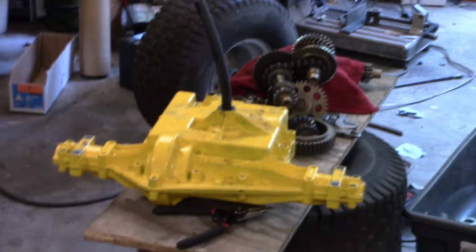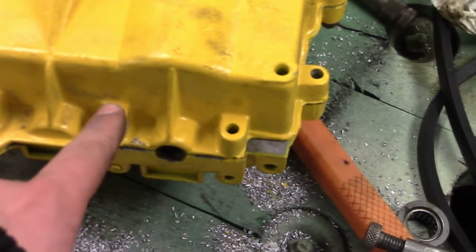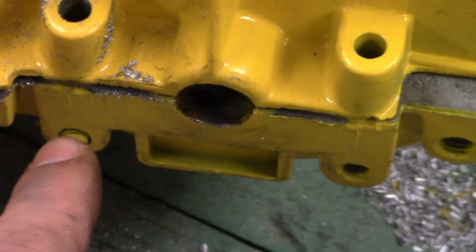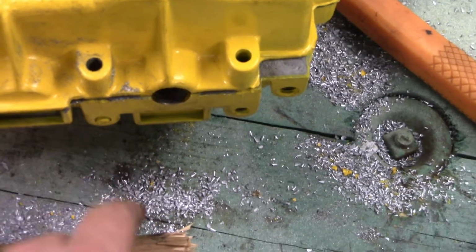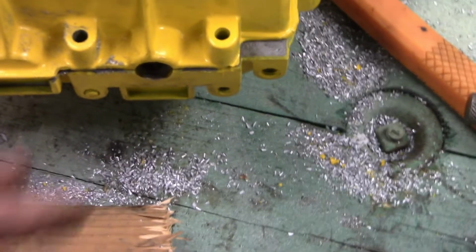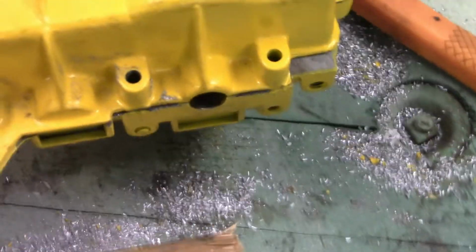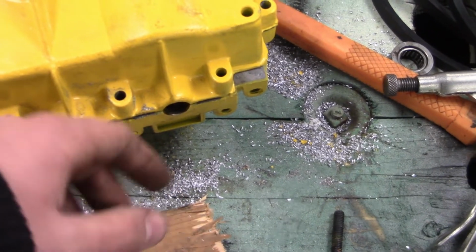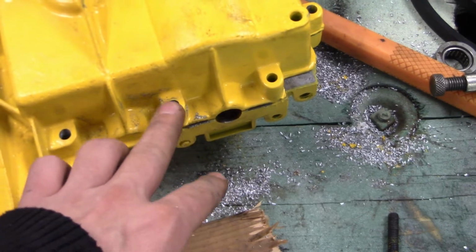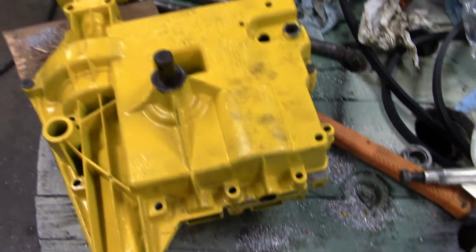On that one, I left the 2 brake holes untouched, and I was planning on doing it on this one, but I totally forgot about it, and I started drilling that. I pretty much drilled till I hit that bolt, so I stopped. What I would do is try to take that broken bolt out, which I most likely hit, and that's what stopped me. So hopefully I didn't mess up the threads too bad. If I did, I can just oversize it one and put a self-tapping bolt in those. And I think what I can do is just drill this out one more, and then get a stud and put the stud in here. So stud, put another nut on that. So I'll probably do that, and then we'll be all good on these.